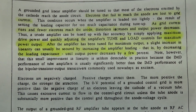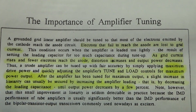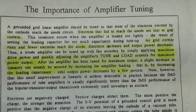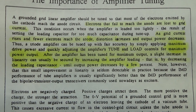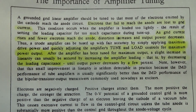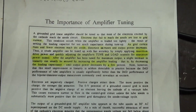You're going to kill your amplifier or kill the tubes, and sometimes killing the tubes is going to cause you to kill other stuff too. Mostly that first paragraph that I highlighted covers it; the rest tells you why, which is probably beyond people who don't have a basic understanding of electrons, RF, and charges. Not important that you understand all that — just understand that you tune your amp for the most you can get out of it, and then if you want, you can detune it a little by decreasing the load. But first you have to know which way decreases the load, because if you increase the load you will also detune it but you're just making it worse.